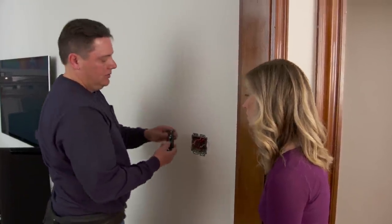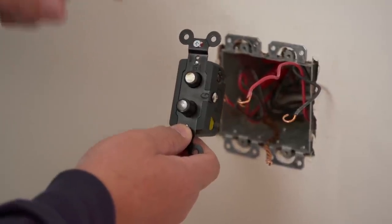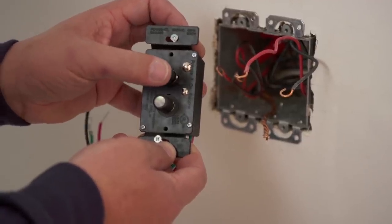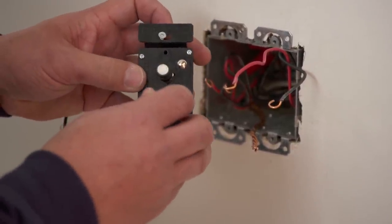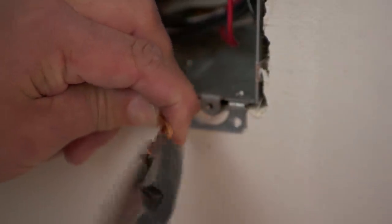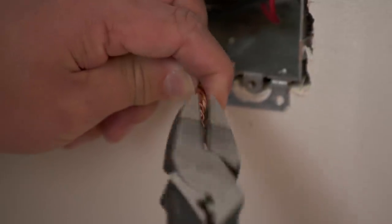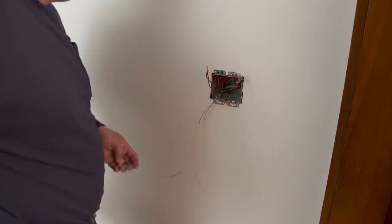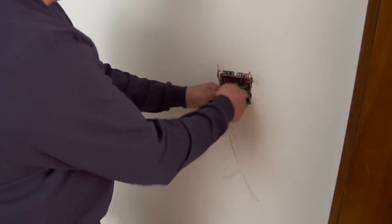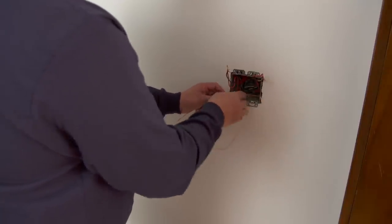So let me show you what we found for our new switch. This is a reproduction push button to match what you have in the other bedroom. This reproduction matches all of today's modern safety standards and gives us the same look. Then for the dimmer — a little different with the same kind of look — the top pushes in and out to toggle the light on, and the bottom dial is the actual dimmer. We do want to add a second ground wire since there wasn't one that went to the other device — one for this switch and one for the other switch. We'll trim that off flush and reinstall a wire nut to hold all of the grounds together, then tuck that right in the back of the box.